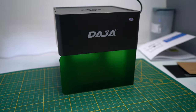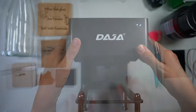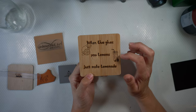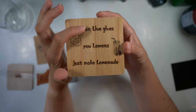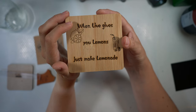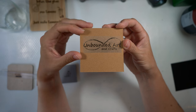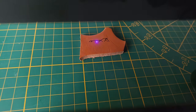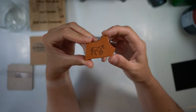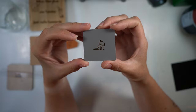I've been trying for a while — it was just engraving on the cardboard and I don't know what I did wrong. I tried one last one with my own design. Here are my final thoughts on the laser engraver from Daja. Does it work? Yes. On bamboo it's really hard to get the lines even when doing several passes. I like the thin lines for details but also the bigger lines — you could even add resin. The laser was at 80% and speed at 70%.